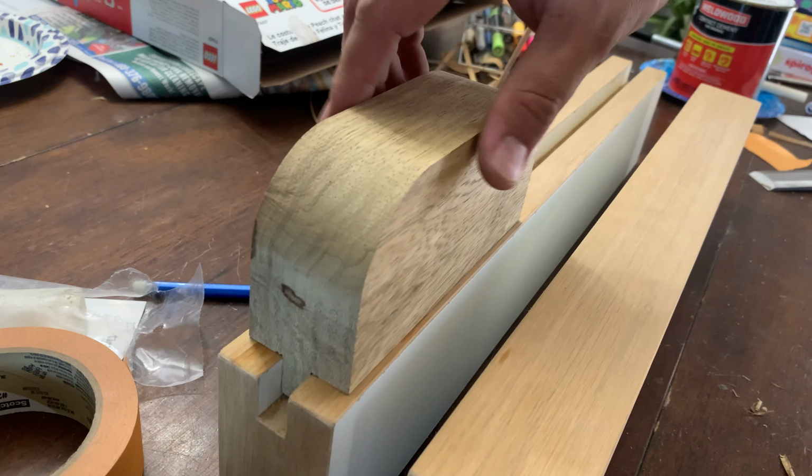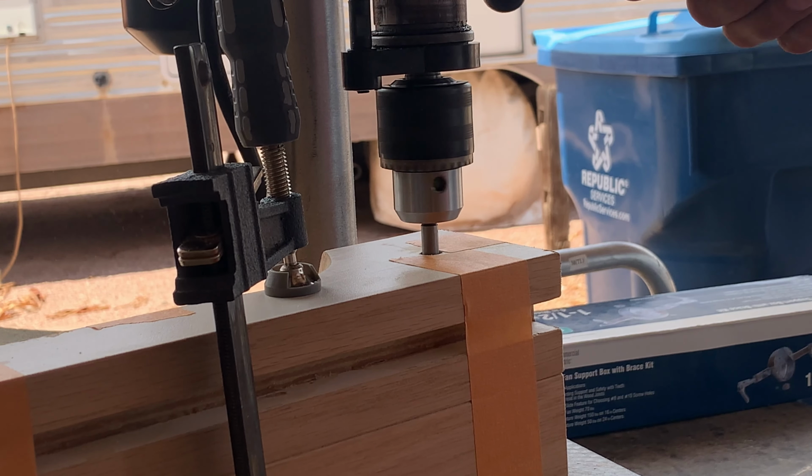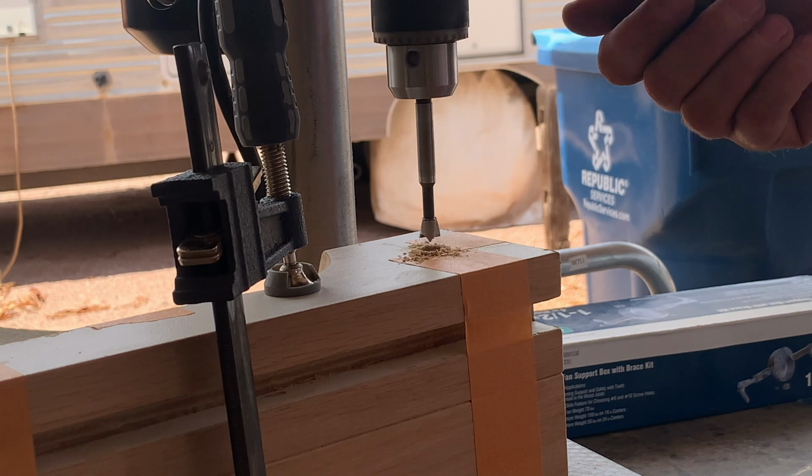My drill press does a pretty good job of drilling accurate perpendicular holes, but just to be sure, I taped both sides of the press together so that even if the hole was slightly off, at least the two boards would line up nicely. The total thickness of both boards was a little much for my drill press, so I drilled through the top board and just a bit into the second, then untaped and separated them and finished drilling through the second.